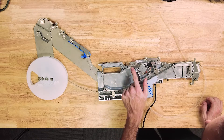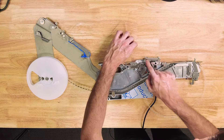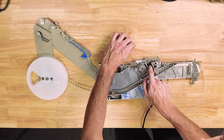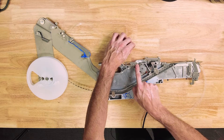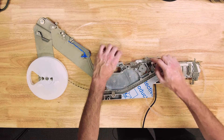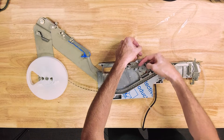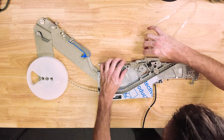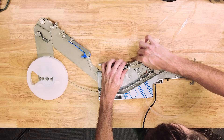This type of tensioner is much more simple. The tape just gets pulled over this idler and this sprung pulley. There's actually a Hall Effect sensor that's measuring the tape tension to stop the tensioner automatically. If you do this while powered, you can feed the tape end into the tensioner and it will just pull the tape until the tensioner picks up. Without power, you can depress this spring and feed the film through by hand.